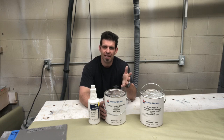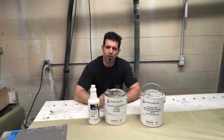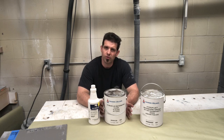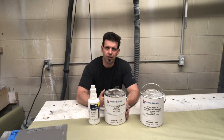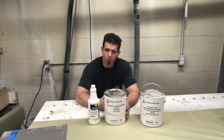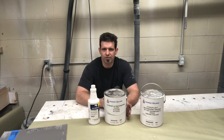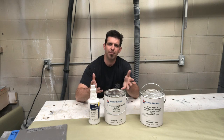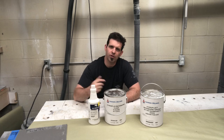It's not a very high solids product — only about 20% solids — and it's really thick in the can, which was kind of confusing to me. The clear does shoot fairly well out of a turbine unit, not as well on verticals because it's thicker. I wouldn't really thin this stuff because you're only talking about 20% solids — you start thinning it and I don't think you're going to get a very good build. It works great out of an HVLP — you've got to crank the pressure up to like 30 PSI to get it to lay down really nice. On verticals it's okay. If you have oak, it works great because it has time to flow into all those pores, but on maple it's not quite as good.